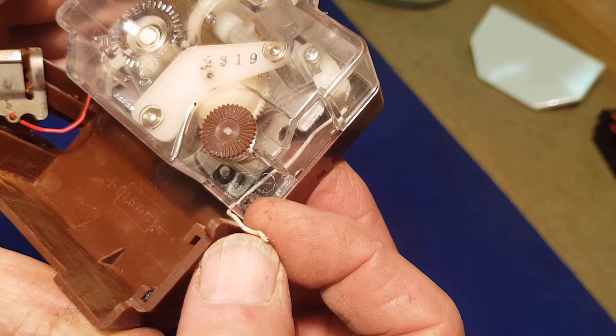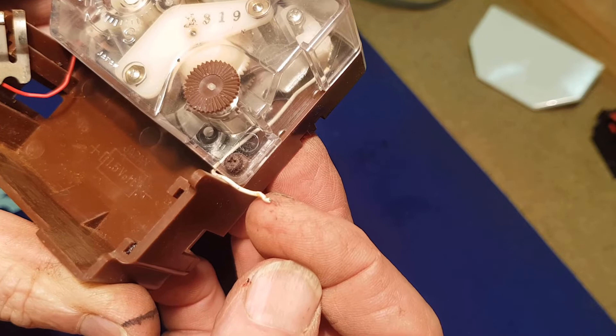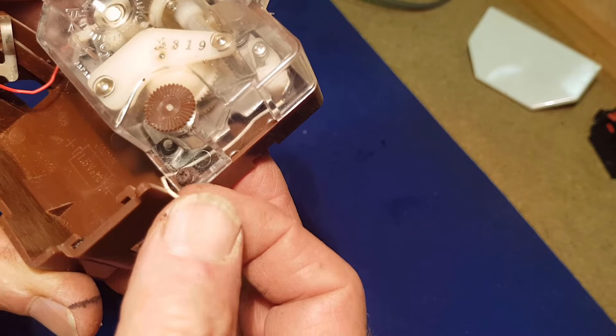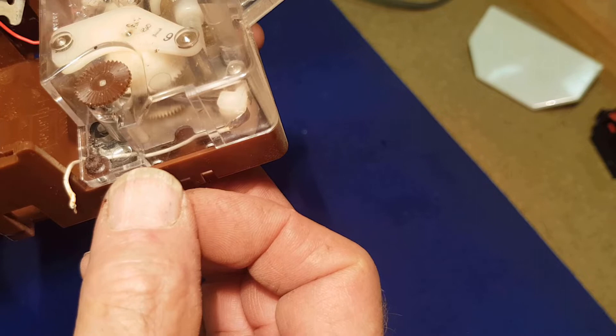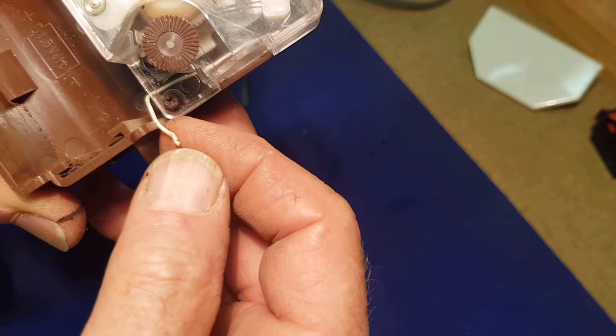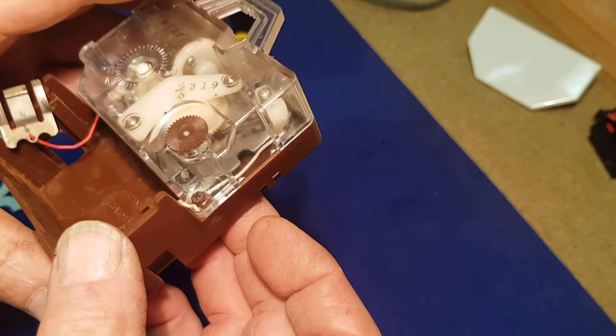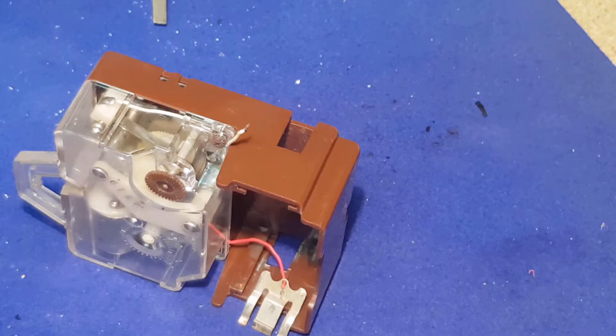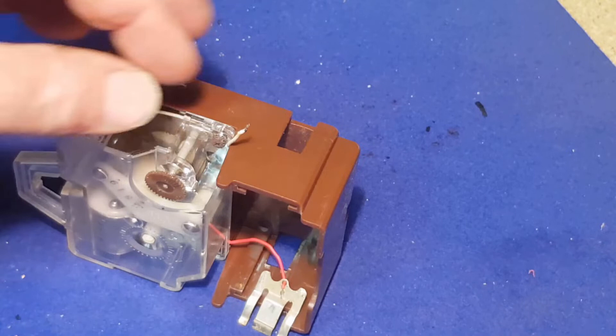The wires came off the remains of the terminal and it looks pretty good - probably a little corroded on the end. I'm going to try and hit it with a soldering iron. I'll just carve a little bit of the insulation back and solder a little bit on there, and hopefully the solder takes to it. If you do get corrosion right down into the wire and it's much shorter, we'd have to take the cover off the movement and replace the wire from that tab. But if solder takes to the end it will be fine. And scraping the bit of corrosion off the wire helps as well.